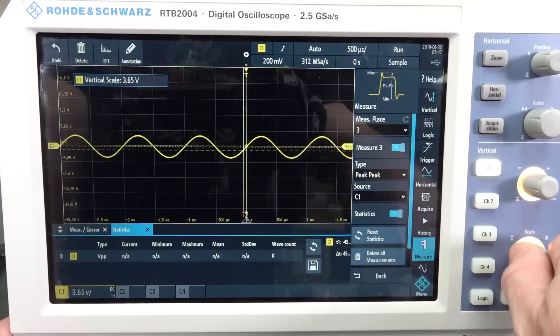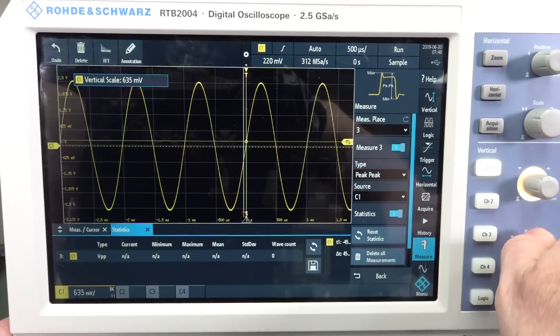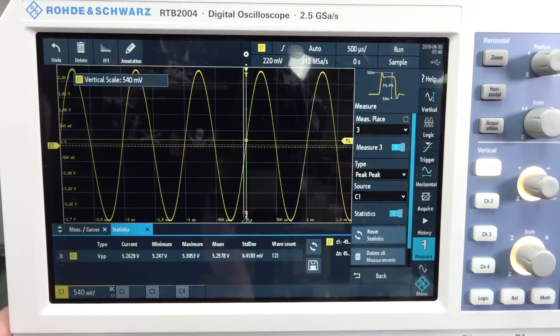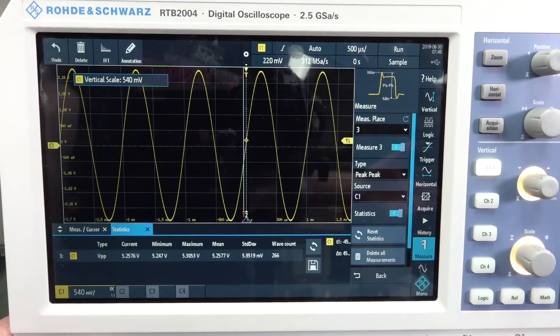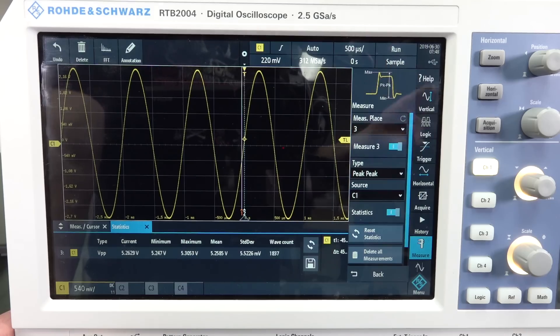That's a neat way of using your vernier to maximize the accuracy of your scope. Of course, it must be said that oscilloscopes are inherently not that absolutely accurate — go and check out the specs. Rohde & Schwarz is in the order of like 1%, half a percent, or even a couple of percent absolute error. So they're not the best things for measuring absolute values, but if you're measuring differences between signals, all that extra resolution matters.